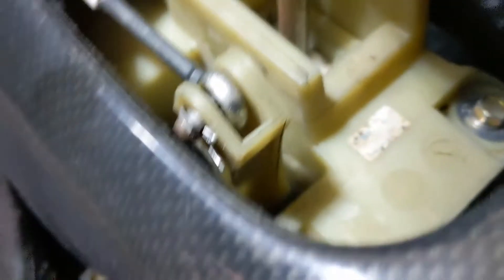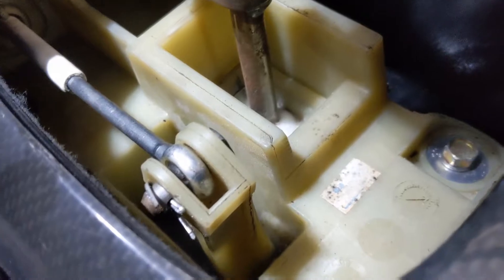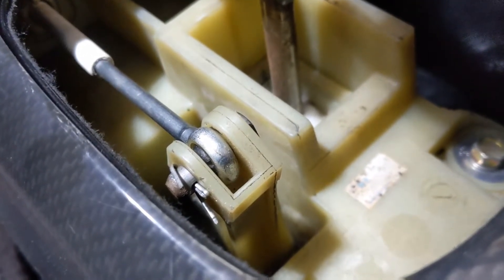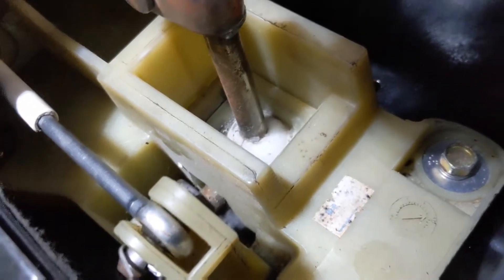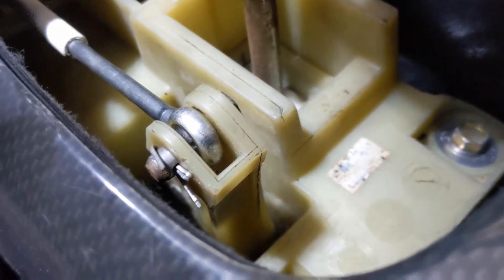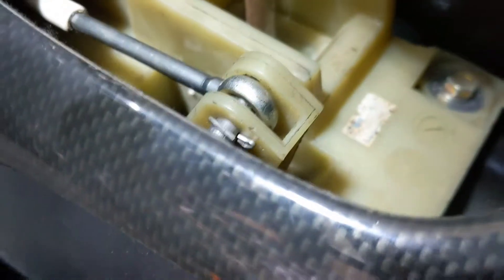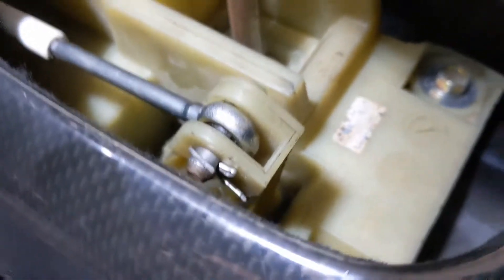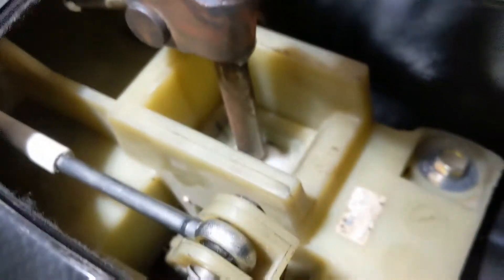I had to use the back side of a razor and then pushed on the other side with a pair of pliers, and I got it to slide right in. Once it's in there, it's good. It was a little more of a pain in the ass than I thought it was going to be, and I'm sorry I couldn't get that on camera. In order not to damage the Delrin, don't just take a pair of pliers to squeeze it in. You're going to need something flat and hard, then push on both sides and it'll pop right in. Once it's in, you can spin it freely and it won't pop out. Then put all that back, put the pin back in, and you're good to go.